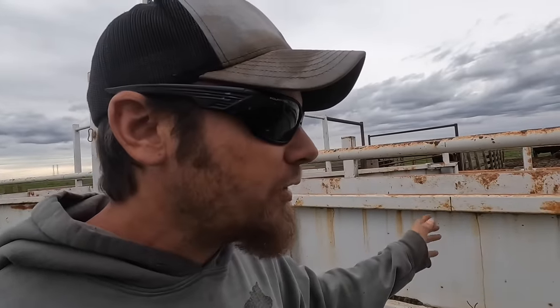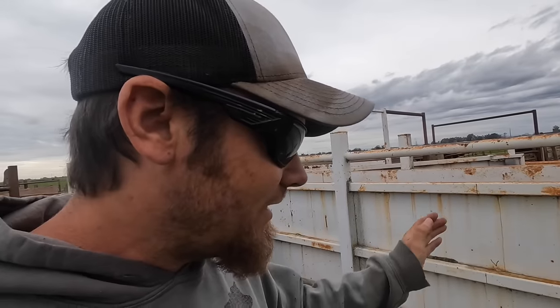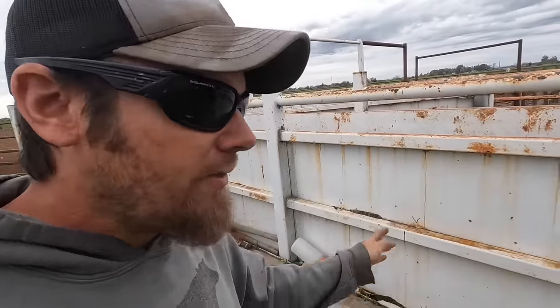I feel pretty good about where I've got all my marks for the cuts. Breaking it down into steps, the first thing I'm going to have to do is cut this catwalk off because it'll be in the way for everything else on this side of the alley. When I come back with all my cutting tools the catwalk will be the first to go. I'll also bring my torch because a lot of this stuff I can just rough cut and break into smaller pieces to make it easier to remove — the torch would probably be the fastest way. For the precision cuts I'll use other tools.